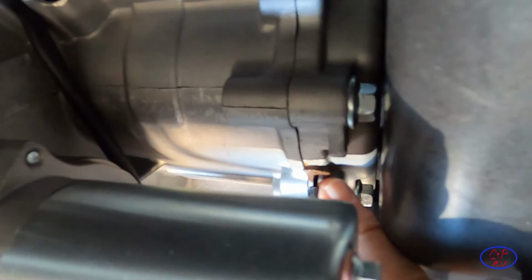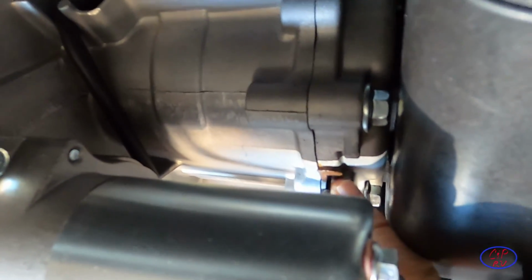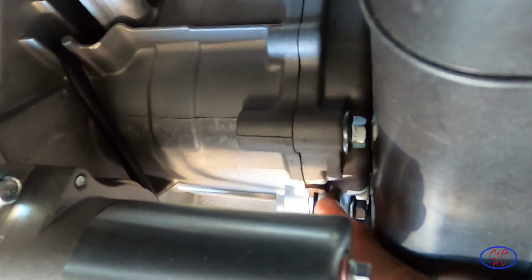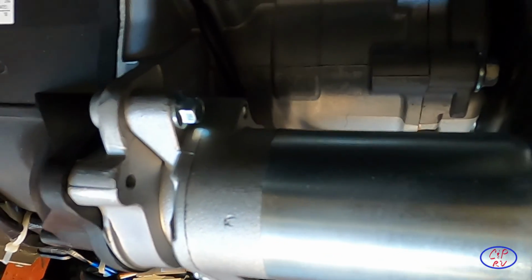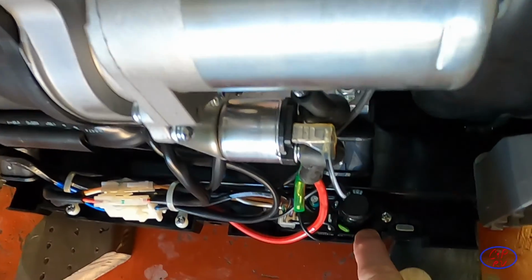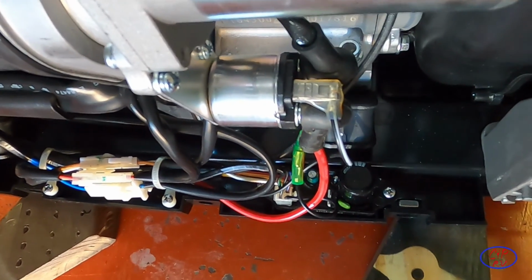So my plan is to put the Permatex Ultra Black right in this area right here, get it in and out of that hole a little bit to close that hole up. And then the second thing I'm going to do is try to put a loop in this wire, but over here on the side where it won't leak down into the ignition module. So we're going to just take a break here for a minute.